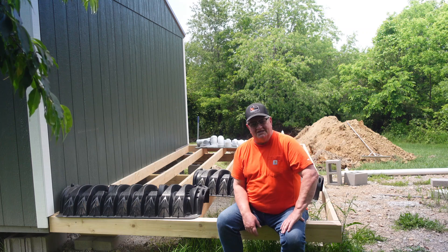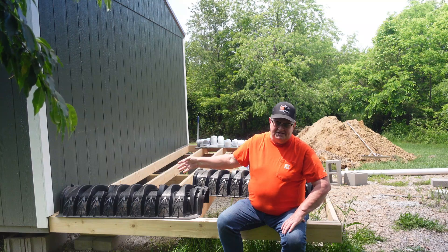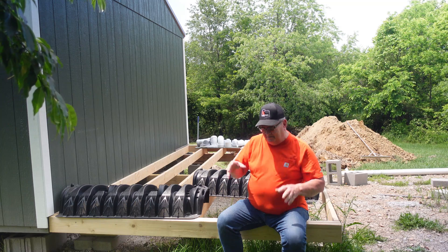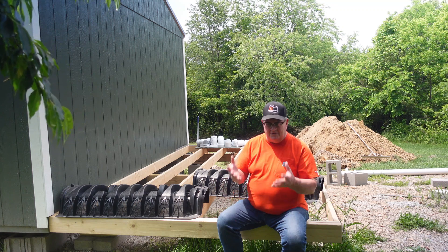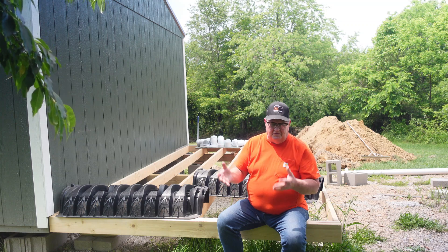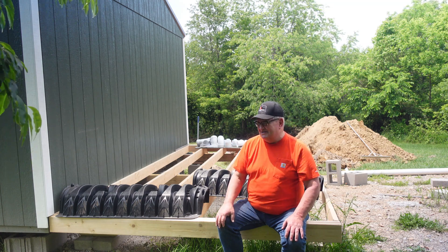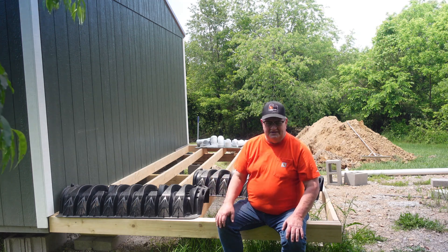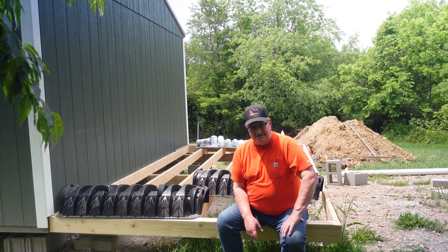I hope that makes sense to you. I passed my first part of the install, so all of that is good. That was the scary part — the tank. We went forever trying to get that thing perfectly level. We dumped 600 gallons of water in — it's got 600 gallons of water in it already. That will keep it from floating. When we start backfilling, it's going to want to push around, but we put over 5,000 pounds of water in it, so I don't think it's going to get pushed around too much. Everything passed and I'm just tickled to death. So now we can go on to phase two. I just thought I'd take this opportunity to explain what infiltration chambers are, since I mention them so often, and how simple they work.